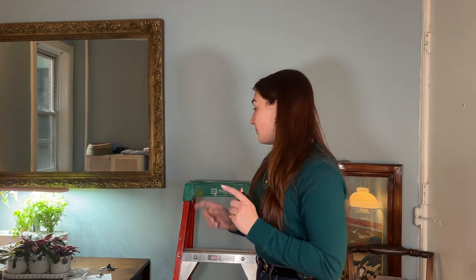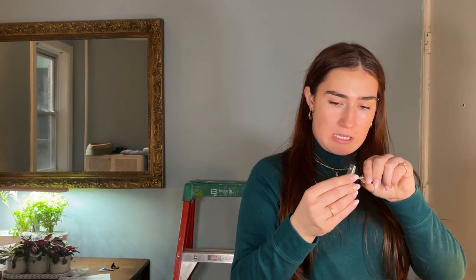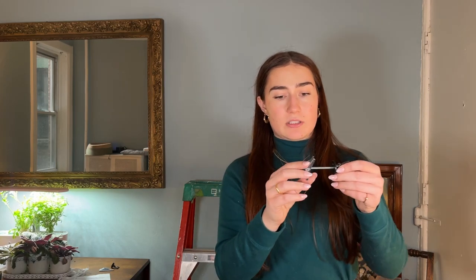It needs to be able to jut out and hang on this, and this should be the perfect size because my mom used plant rings when she had these pieces of art at her office. When I was doing it before, the standard size was too small, just a little bit too small. So I got the hole big enough to go in to put the anchor in, but I needed to get longer screws. So you screw into this side a bit until it's tight, and then you're also screwing into this little hole that's here. This should be a good length. The nice thing about the long ones is if you've got a little bit of room behind your wall you can make them a little bit smaller or longer depending on what you need. You just close this little thing, make sure the hole in your wall is big enough and goes deep enough, and now I'm going to go put it in.